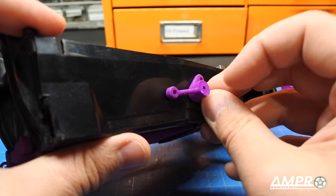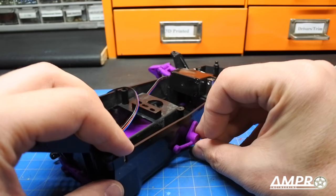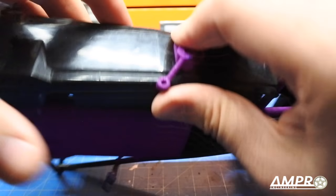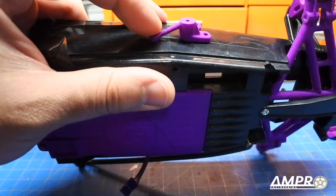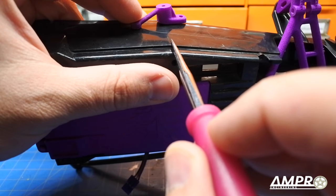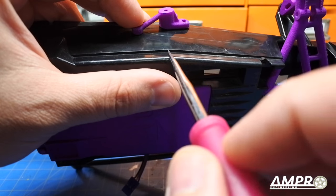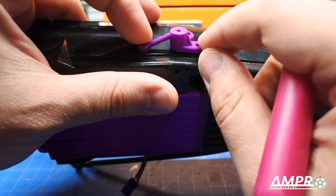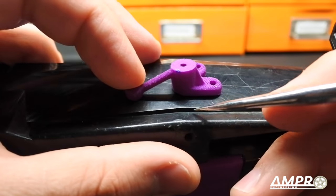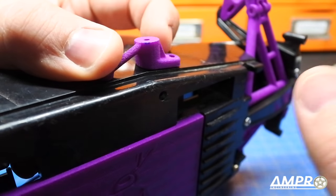When it is installed, this wall here is perpendicular to the ground — it is perfectly vertical in comparison to the ground around it. We are going to want the back edge of this to be lined up with this crease in the chassis right here, and this edge here will be parallel to this edge but one millimeter up from it, so it will be right about here. We are simply going to line it up — this is not an exact science.